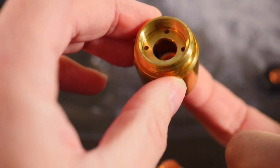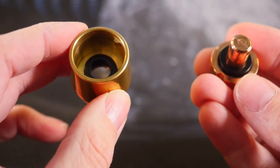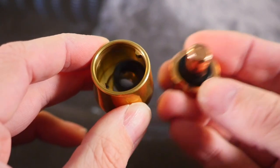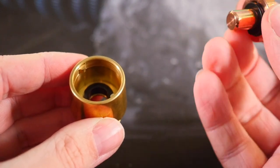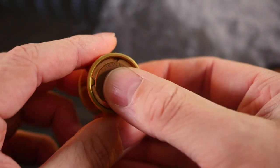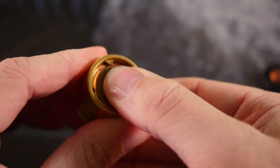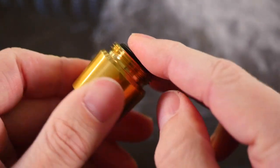So there's the opposing side — we set this one here, take this one and put it here, and that's how it works. These opposing magnets create a cushiony spring of magnetism. The easiest way I've found to get this back in is to put it on my finger and place the housing over it to get it centered. Be careful when putting it together — don't get them too close or the magnet pulls back out. Flip it upside down, push it in quickly, press it down and turn to the other notches, and there's your switch.